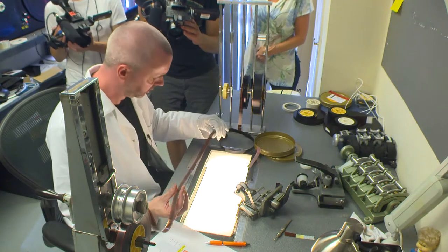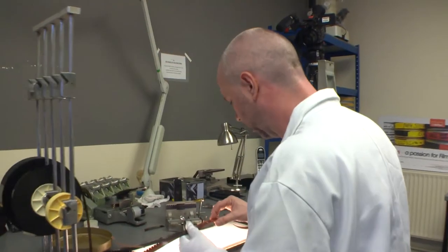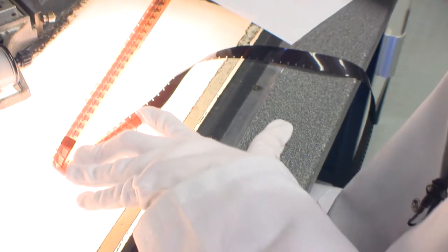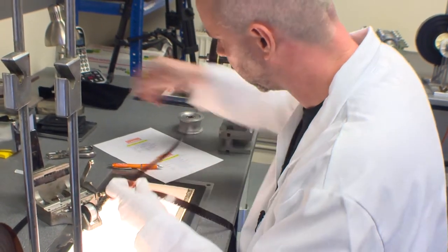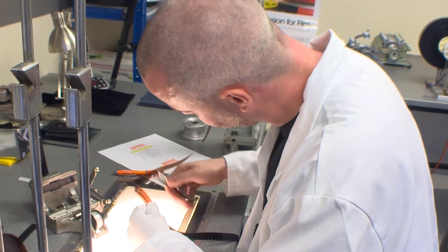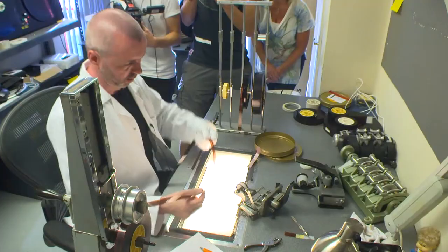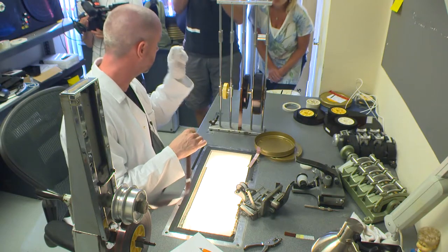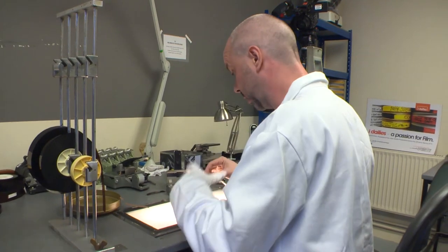So now I've got to the head, and I need to punch a hole for the telecine op to start. And right at the end here, I've got a whole complete edge number. So I'm going to write that edge number down. I'm also going to punch a hole in the dot frame. So when this gets put on the telecine machine, he will run this from the heads, and he gets that dot in the middle of the aperture of the telecine machine, and you'll see it on the screen, and that's when he starts recording the edge numbers and the action.